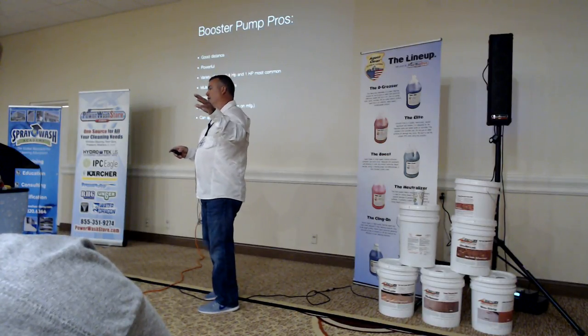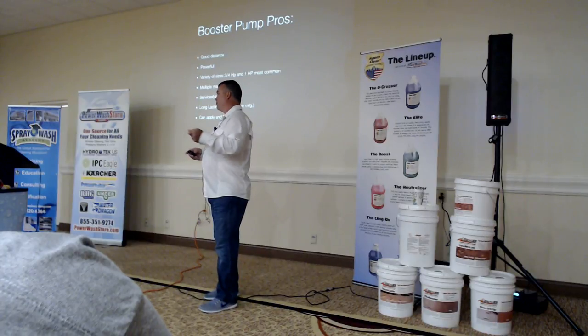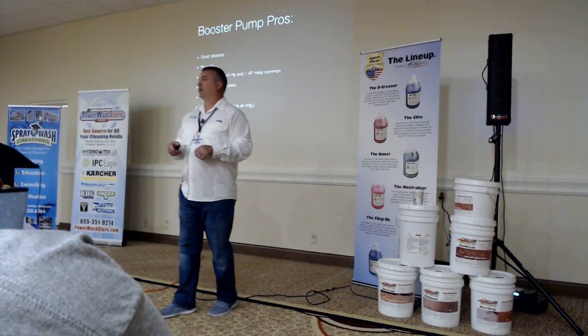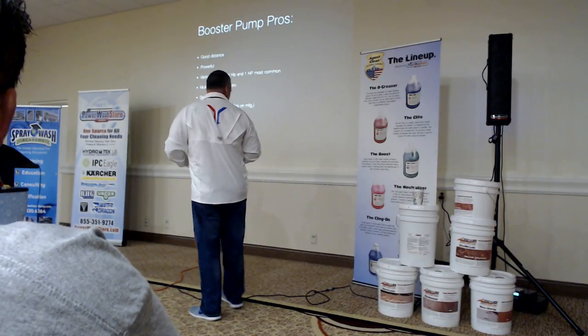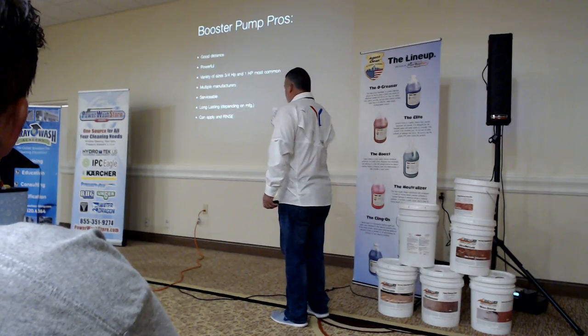Pumps of the past would draw 14, 15 amps. Well, that's right on the edge of tripping an exterior GFI, or the breaker. If you're pulling that much, there's a light on or something, God knows, a refrigerator could be plugged into their garage.